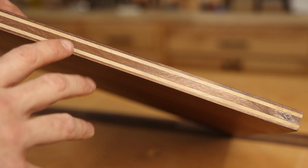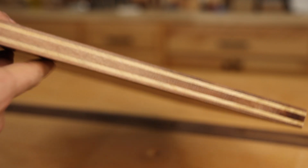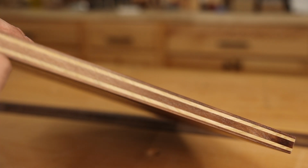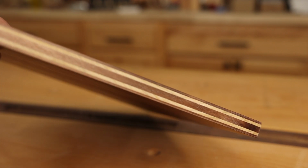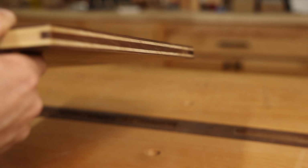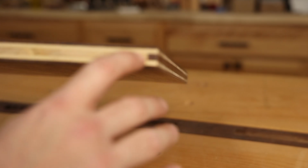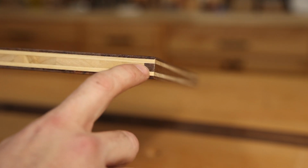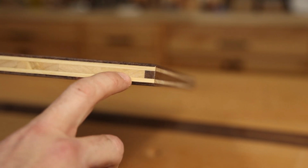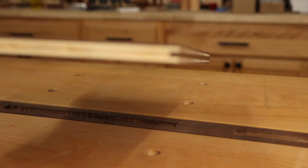And as you saw in my mistake here, what I was attempting to do with this walnut piece was actually have walnut edging, with the veneer going over the top so that that could be totally shaped and profiled and it would be walnut all the way through. What I forgot about when I was building it was that on lumber core, the veneer goes on a cross-banded layer instead of just over the core. So I'm used to using plywood, adding edging, and then veneering over the top. Well, that doesn't work on this one.